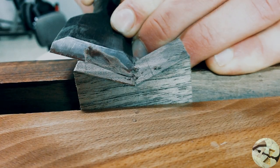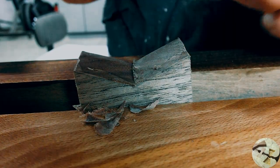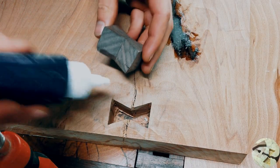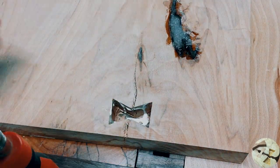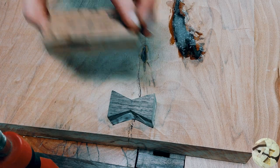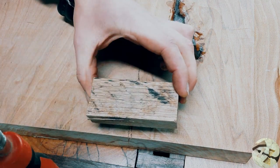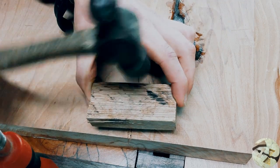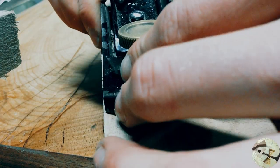When I started this build, I knew that the table leg had a few cracks and minor defects that would have to be dealt with, and the majority of them I filled with epoxies, you can see here. But for this one at the base of the leg, I thought a bow tie in walnut would look quite well, and be perfectly strong enough to hold together that little split. Also, I really like bow ties, as my channel thumbnail might suggest.